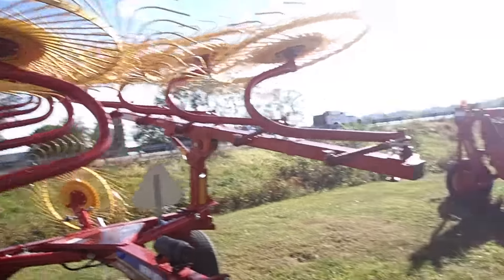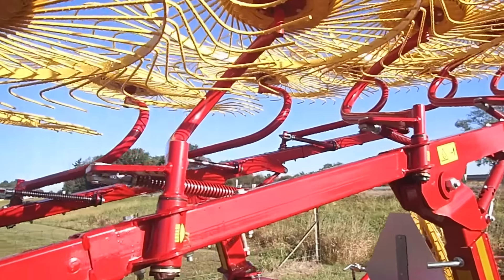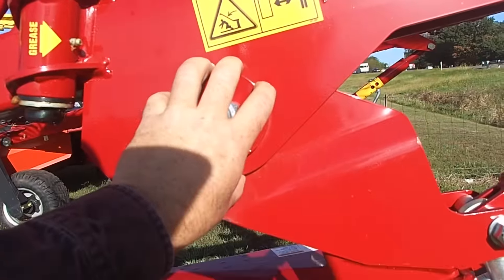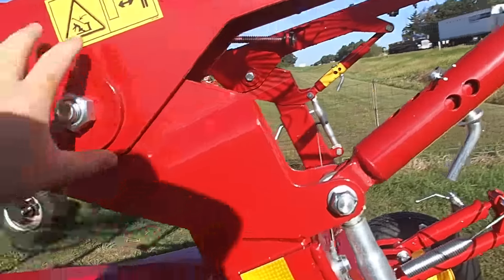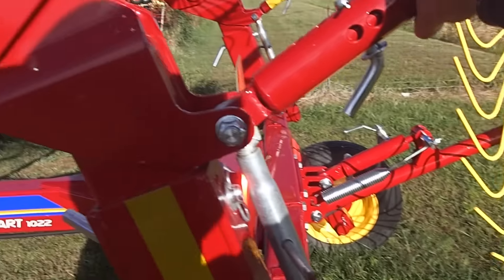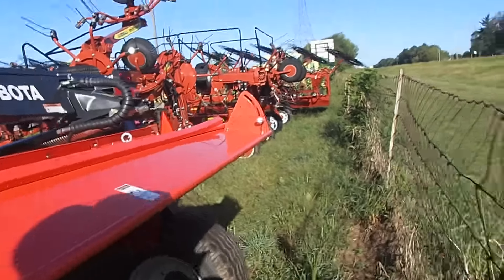This is only a 10-wheel rake, but I do like the way it is put together. If you guys are wondering why I'm looking at a different rake style, I'm having problems right here on my H&S rakes. This is not heavy enough, they're starting to break apart, and this is just very different. I like this system better. The reason I am going to be moving away from the H&S rakes is because they do have some minor problems that I just don't feel are worth it to me.